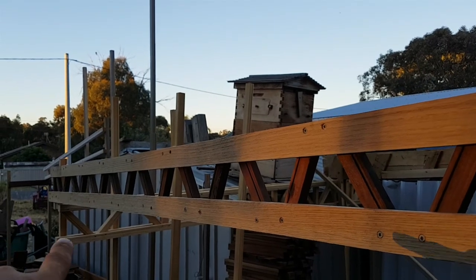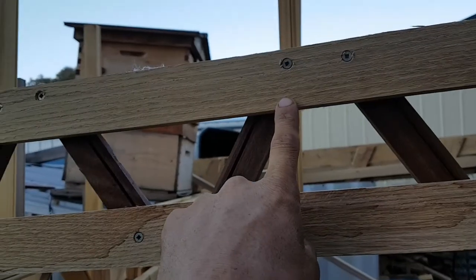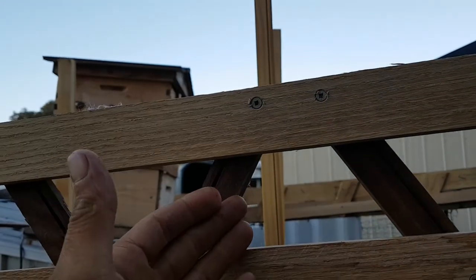Before any engineer says, hey, you've got a butt joint in the cord at the high-moment area — yes, that's a legitimate concern, but there's going to be a support there. And before anyone says you're using inch-and-a-half, 32 by 32mm things as posts — yes, I am, and it is perfectly strong enough if you do it right. It's not standard construction because it's not economical — generally time is money and it's just easier and cheaper to use more wood. So let me know what you think. If you're going to criticize my technique, that's fine, but keep it civil. I'm the first to admit I don't know everything, but before you really go hammer and tongs — especially on the theory — unless you're an engineer who actually knows what you're talking about, make sure you know your facts, because I'm better educated than the average bear.